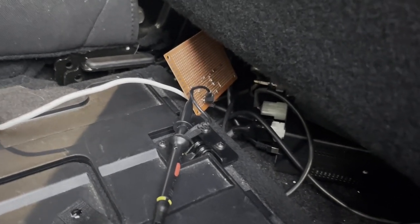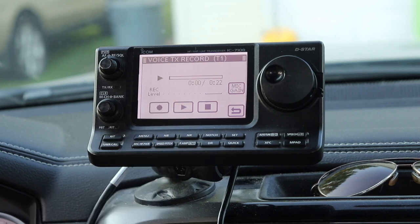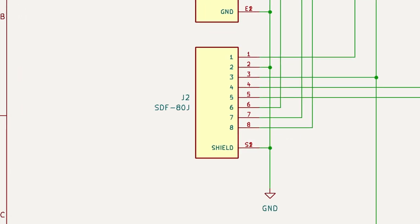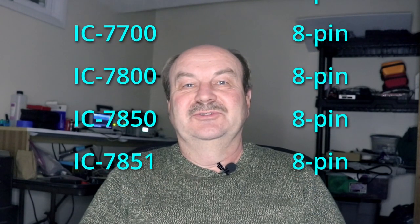As I mentioned in the last update, I'll decide on a production unit depending on how inexpensively I can get them made in small quantities — I don't want to be trying to sell anything that's going to be super expensive. If you've watched this as it's come along, you know that this project started out as just a squelch circuit for the 7100, and I also discovered there are a few caveats with squelching the audio on the 7100, although for certain use cases it still works fine. But I decided to expand it to some of the other signals. By adding the 8-pin connector to the board, it also works for several other ICOM models. As I was researching this, I didn't realize how many models this was going to work for — it turns out ICOM has been really consistent about how their accessory interface operates for quite a few years. So this circuit, when it's done, is going to work for all of these ICOM radios that you see scrolling past here.